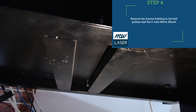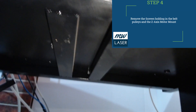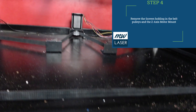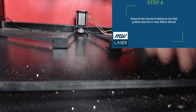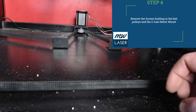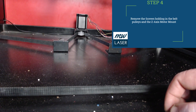If we look under the machine, we've also got two rails going from the front to the back. Into those are screwed the pulleys for the z-axis and the belt drive system, so because the bolts go into those rails you'll also need to remove those. Also check to see whether the bolts for your stepper motor mount protrude through the bottom of the machine or whether they go into the back rail — if they go into the back rail you'll need to remove those too.